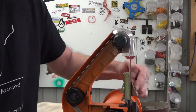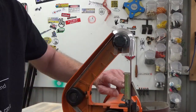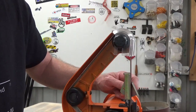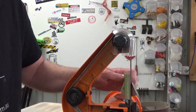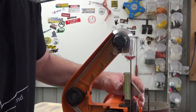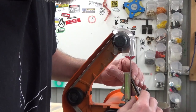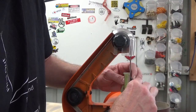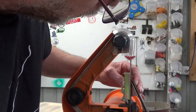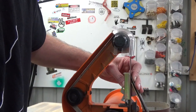So you can see we've got a plate here. This is adjustable. We've got the backing board here, and there's a spring-loaded clip in here. You can't really see it, but there's a sharp little thing here. That all lines up. On the back, 2 screws. You undo the screws and this moves. Now for a chisel, I literally do this. I get that up there, I get that to sit flat, and you can feel it when it sits about right. So now when we come up there, slide that up gently, and there you go.